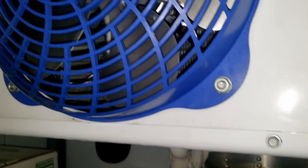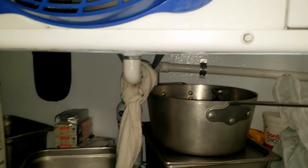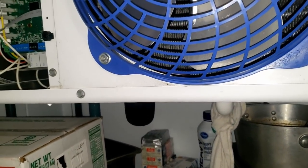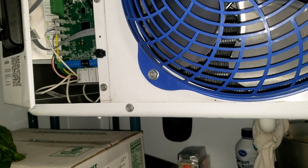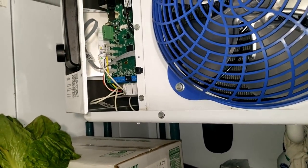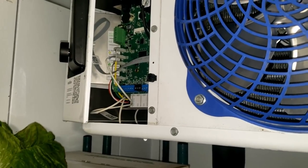That's leaking refrigerant through. It's getting super cold, making this thing sweat like crazy, which then makes the dripping going on. And that's what's going on. So it's got some issues, obviously. The stepper motor must be garbage, because it's saying, like I said, that it was at the zero point, so that's your issue. Not much I can do with it tonight, guys. Not much I can do at all.